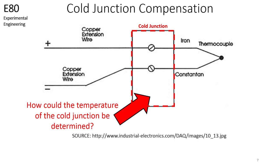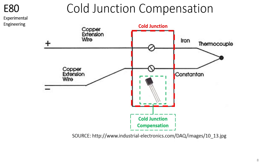However, unlike an ice bath, the temperature of the cold junction needs to be determined. Well, if you remember the concepts discussed in previous videos, you should now have a working knowledge of two other temperature sensors. For example, the cold junction is typically located in an environment that does not undergo rapid changes in temperature, such as the inside of an AUV. We can certainly use a temperature sensor that has a slower response time, such as an integrated silicon linear sensor that also outputs a voltage.